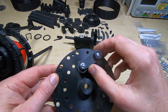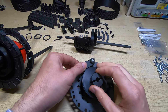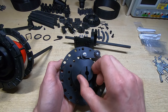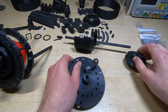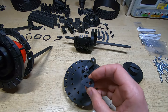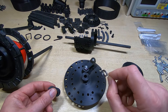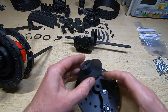The detent wheel is bolted into place, pivots as it's supposed to, and the wheel rotates. It goes into a dip and is resistant to come back out — you can feel that with the crank handle, which seems to work. Now I'm going to fit the pawl — the anti-reverse rotation pawl — which stops you turning the machine backwards. It fits in a similar way on a bearing with another homemade spring and bolts to the bearing plate.